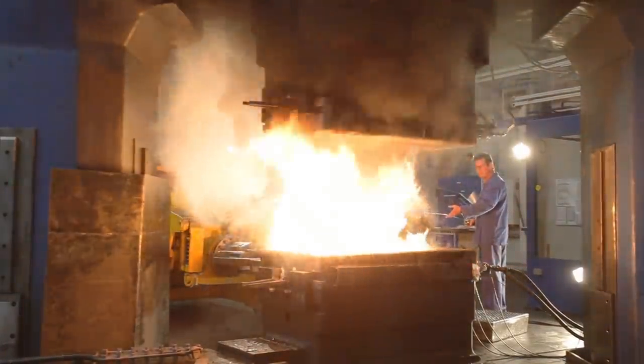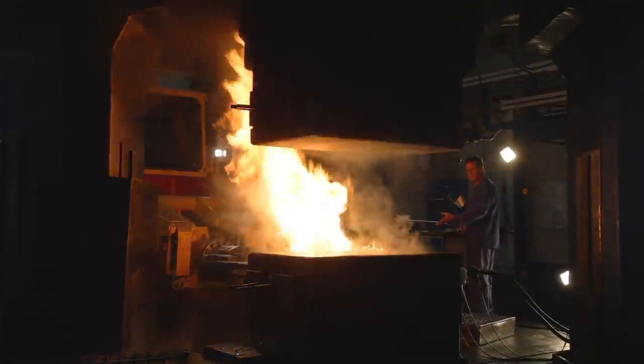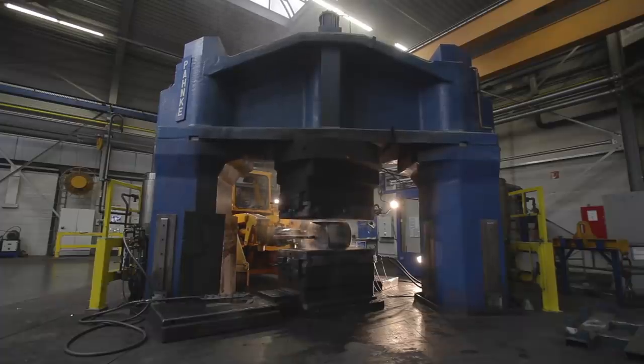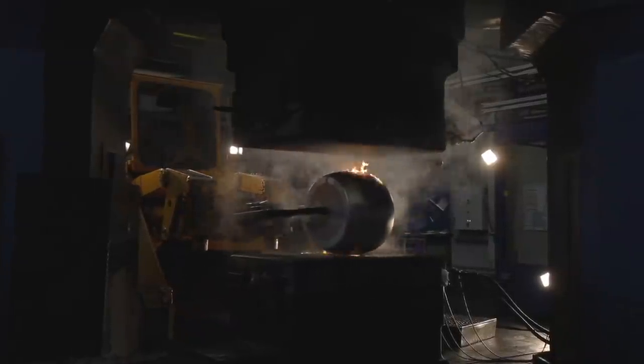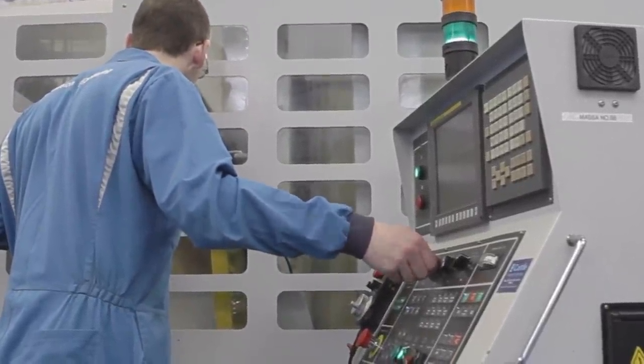They put together the team that actually allowed us to do this. It's a team of fantastic companies that allowed us to do everything from melting the material. So we have a custom melt of aluminium, to being forged by Otto Fuchs in Germany, having the metal cheeses, for want of a better word, squeezed and pressed into shape to get really good grain structure. And then back to the UK, to Glasgow, to Castle Precision, to do that final machining to the same level of tolerance as you'd need for the inside of a jet engine. And that's what produced the wheels.